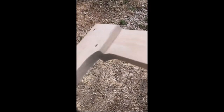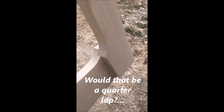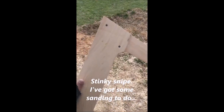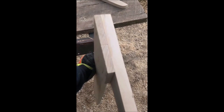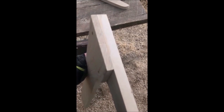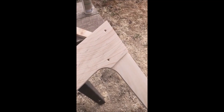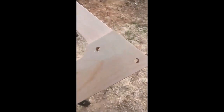What you can see here is just a modification of a half lap joint — I've put a lap on one on the leg but did not use a lap on the stretcher. It's an angled table, so you can see the angle. What I've done is glued and used a one-inch drywall screw simply to provide clamping pressure while the glue set up. I did this yesterday so the glue set up for a good 24 hours. The next step is to remove the screws, which is what I've done on this one.